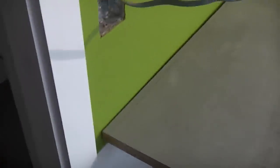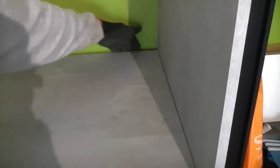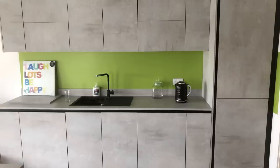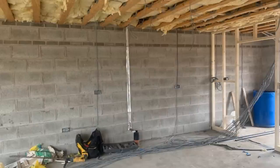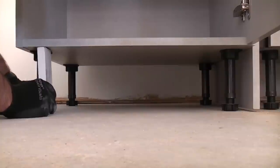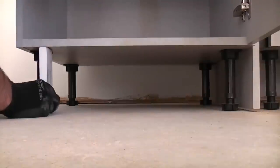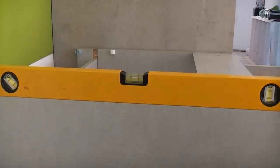You can see how far out the wall is when the worktop is put in position for marking - it's touching the tall end panel. The worktop is also touching the wall at the opposite end yet there is a huge gap. In this second example I'm fitting a longer batten to a wall that is dot and dabbed, meaning the wall is solid but the plasterboard is adhered using drywall adhesive. I've worked out how high the batten needs to be by adjusting the base unit to the correct height so that the plinth plus floor covering will fit under the unit. I can then set the batten just below the height of the unit so that the worktop will not catch the batten.